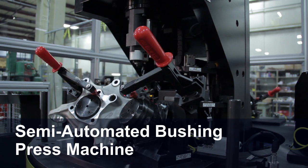This client really specializes in the knuckle industry — it composes about 90% of their business. They cast the knuckles throughout the system, then go through the machining process, on through the assembly process, and out to the end user. We are ultimately trying to accomplish a complete assembled part with three bushings and one ball joint in less than a three-minute cycle time.